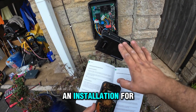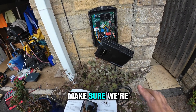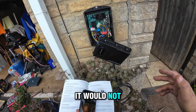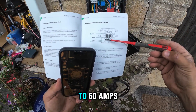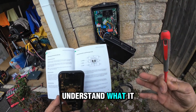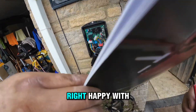What is very important on an EV charger installation — you always must check this. This is the size of the main fuse, but more importantly the maximum demand, just to make sure we're not overloaded. The maximum demand for this property, when calculated, is diversified across a lot of circuits. In this case, calculated maximum demand would not work — it would need to be measured. This is ALM — Automatic Load Management — set to 60 amps. If, together with the charger, the load will be more than 60 amps, the CT clamp will listen and limit the charger to make sure we don't go over 60 amps. You can see it's pointing to number 6 down.